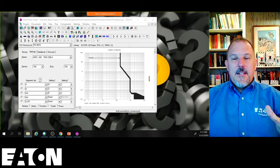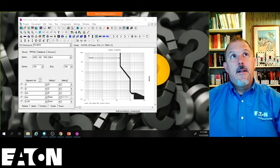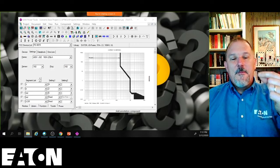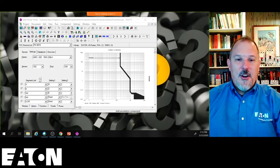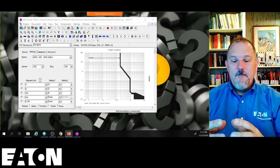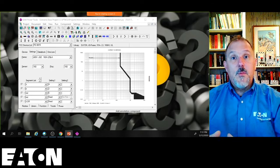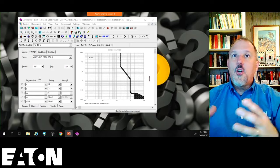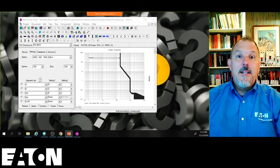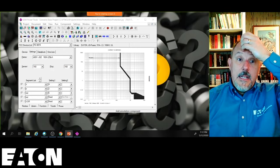I went through that process, and Jim came up with the public input on 240.87. Can't remember, I think it was the 2011 cycle. I remember the phone call conversation on that topic with him as he was educating me on what he wanted to do with the 240.87 and the arc reduction technologies, like the arc reduction maintenance switch or zone selective interlocking or the arc quenching technologies. All of those help address the issue of incident energy, especially in a selectively coordinated system. So I can effectively have my cake and eat it too.